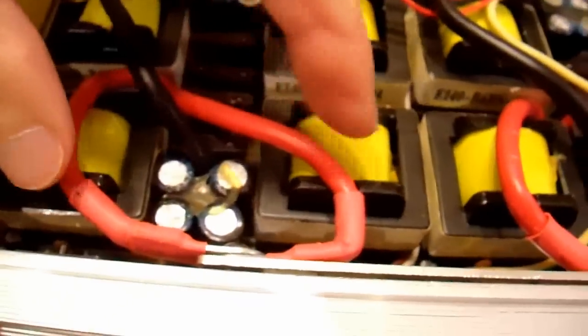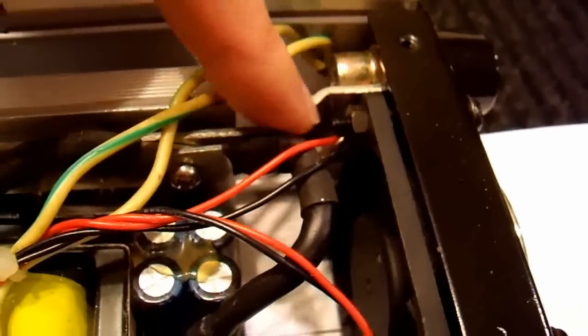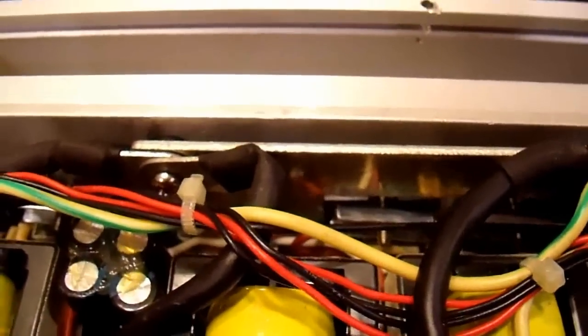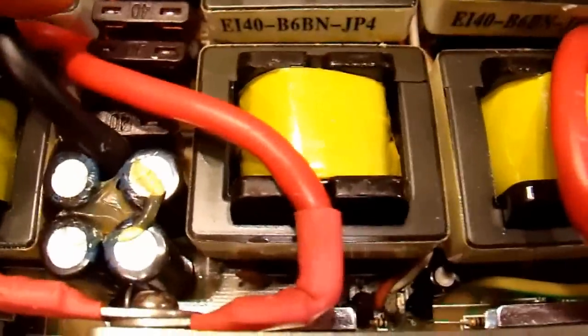It looks like all of the input current has to go through these four cables, which look to be about 10 gauge. That is not adequate for a 2500-watt inverter — not only are you losing a lot of power, you're potentially overheating things. The buses into the inverter look pretty good. They have this steel bus bar — steel isn't the best material for conduction, it's fairly high resistance, but it is cheaper than copper, so given this is consumer grade I'll excuse them for that. The heat sinks are aluminum, which is the proper material to use.